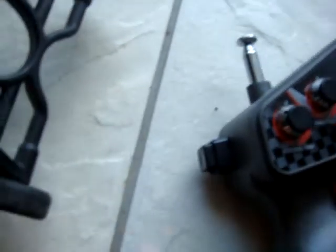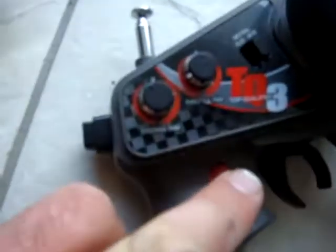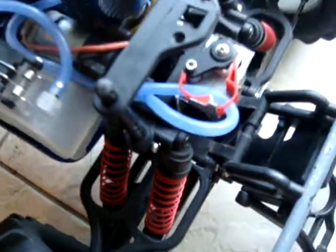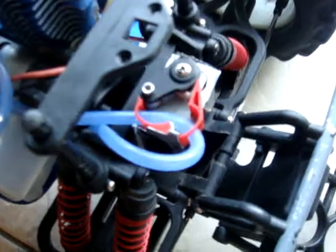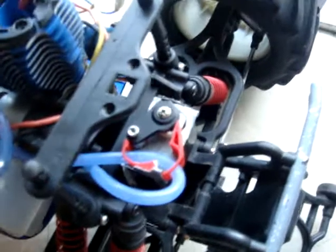Okay, now as far as making it run smoothly and easily, that's the point of the little cutout switch on the side here. We add that. So basically, when we push that switch in, instead of having to hold that and toggle it and get into the center, it just does it automatically. And you'll see that it centers. It's pinching the fuel line now, and if this was actually running, it'd actually stop it. I push it again, and then it relieves it, allows the fuel to go through, so you can now restart the vehicle using the starter system. And of course, when you push the button, it goes back to either the forward or reverse position, whatever it was set at prior to pushing the switch again.